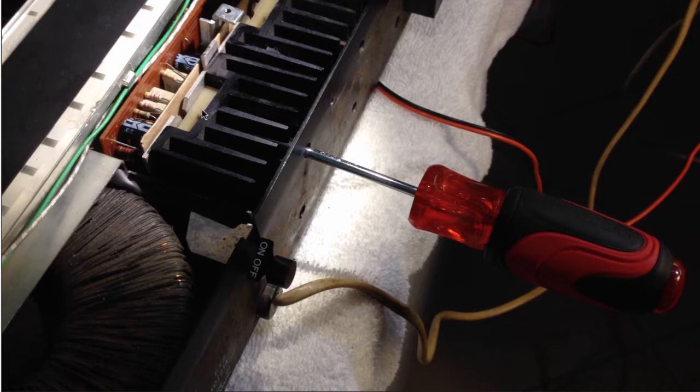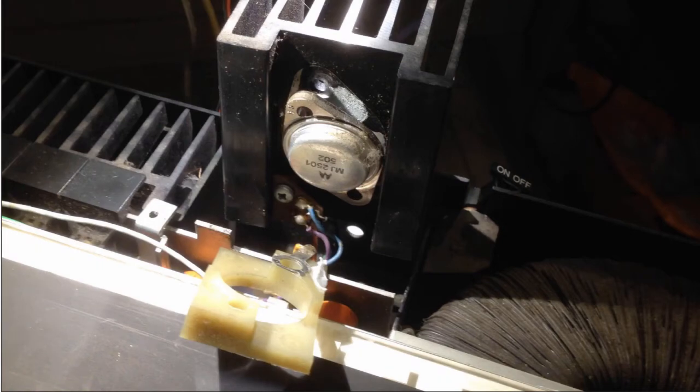There are two plastic protrusions on the insulator that go into holes in that metal bracket. After pushing them out a little, one can then move the heat sink upwards and completely access the Darlingtons that are mounted against them. Here you see the heat sink pushed upwards and the two screws that hold the Darlington are out. You also see the insulator removed. At this point it's pretty easy — you can simply pull the Darlington towards you and access the solder points and replace it.